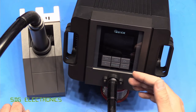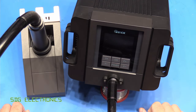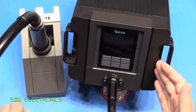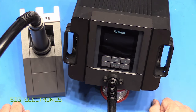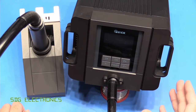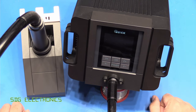They could have just had an extra row of buttons and got rid of that menu — just channel one, channel two, channel three — and that would have been nice and easy, pretty much keeping with the same style button layout as on the other units. The other thing is its cost — this is pretty much double the price of the 861DW and doesn't really offer you anything in performance compared to the 861DW. So if you're thinking about getting a hot air station and you want it to be fairly cheap, the 861DW is pretty much unbeaten in that respect because it just works and is quite inexpensive, so long as you get a genuine one. I know there are some very cheap ones with dubious build quality. The 861DW is still not up there with the Metcal station, but it certainly appears to be safe and I have not heard any reports of anyone having safety issues with the 861DW.